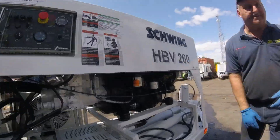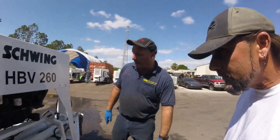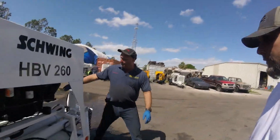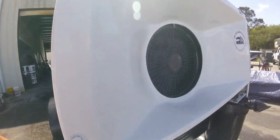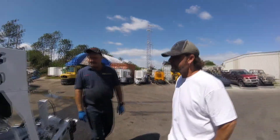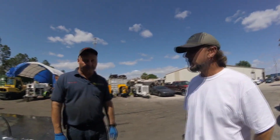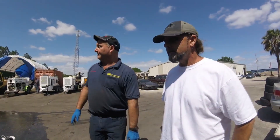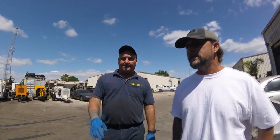The service interval is the same as your 500 — it's 250 hours on all filters: oil and fuel, your air filter, your belt for the air induction, and the hydro filter at 250 hours. We'll use a Rotella 10W-30 full synthetic per diesel, and that's per manufacturer. No 15-40 — the only 15-40 is when you go to a four-cylinder turbo. Otherwise, 10-30 simple synthetic.